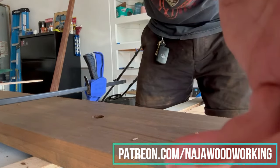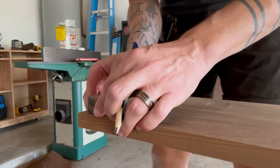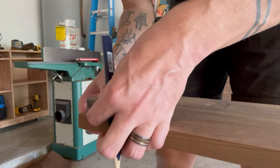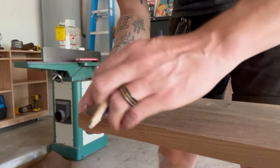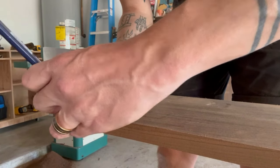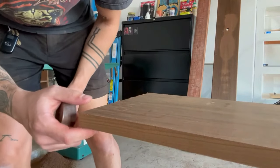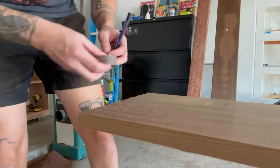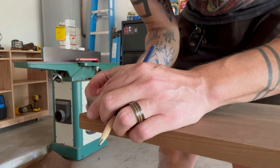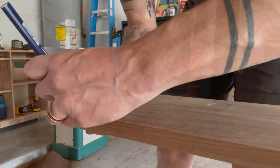The next part is probably my favorite part of the build. I wanted both of these shelves to not only have rounded edges, but also rounded corners. In order for the rounded edges to be perfectly continuous, I wanted to first make my corners rounded so that as I go over it all with the router, I can have one continuous cut. I had a previously cut circle from another project that happened to be the perfect radius for the corners of this shelf. I took that template circle, put it against each corner, and traced an outline.